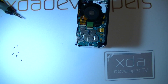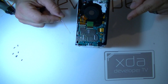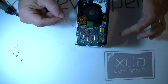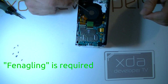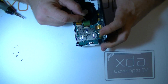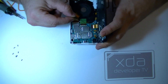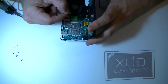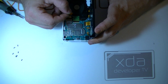So while I was reassembling this device — first off, a couple of notes. This device is pretty darn difficult to get back together. All the tolerances are very small and the alignment just has to be just right for everything to go in. These connections right here were pretty tricky. The other thing I wanted to note is there's a spare connector right here, which typically on Samsung devices would be the JTAG port. However, we already know that JTAG is locked down on this device, so this port will likely be useful for UART as well. We'll take a look at that sometime in the future.